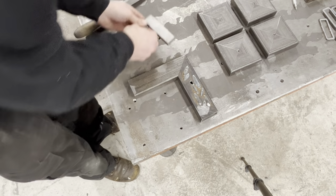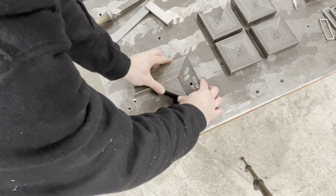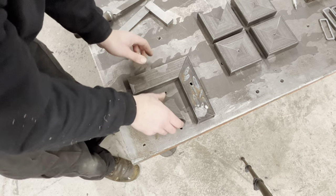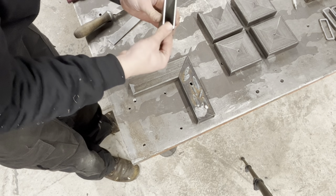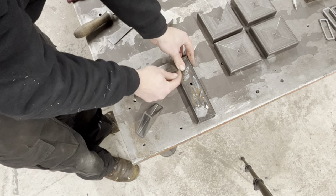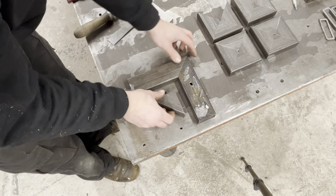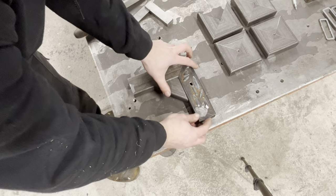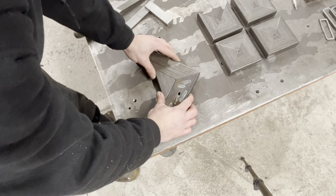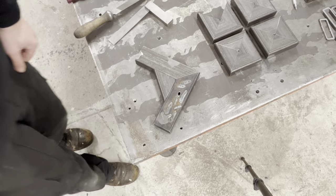So I want this to be 90 degrees, and then this sits in there. Can you see the gap still there? What I do is I take this section out. It's not needed, because that is going to have a weld up the inside, and I don't want to disturb the weld. So cutting that out sort of wraps the weld. You see the gap? It's no good, because we want to put that like that, and that like that. Imagine without the gap.